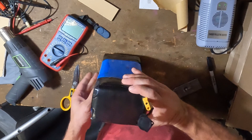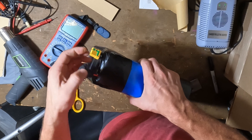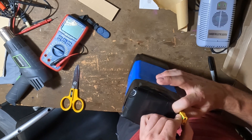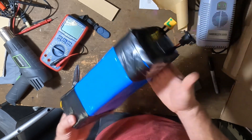It's finished! We have our XLR connection on, we have our XT90 connection on, and we have all the padding around it — it turned into a pretty big battery once we added all that padding. Just used some tape and the rest of my shrink wrap to make it work, and there we have it. Thanks for watching and I'll see you next time.